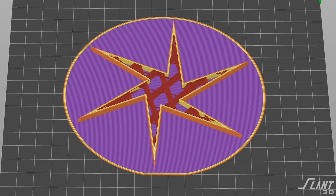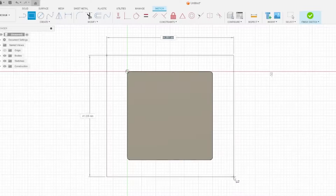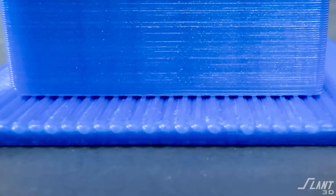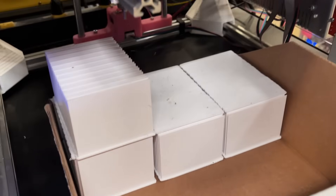If you really have a complex part, you can design in a brim — literally design a 0.3 millimeter plane, insert it into your model, and merge them. You do want it to be round, not square — again, warping. You can also design in a raft by making a thicker one millimeter plane and spacing it about 0.1 to 0.2 millimeters from the actual part. That way the first layer of the part is clean and can come off that designed raft. This is especially useful if you're stacking a hundred tiny parts on one build plate — design a raft so they all come off together reliably.